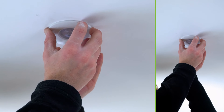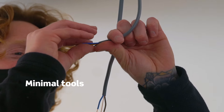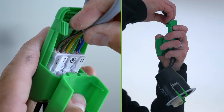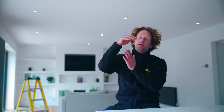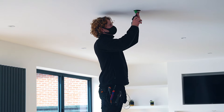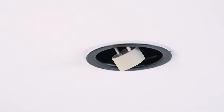The reason this light fitting is so quick and easy to install is because of the minimal tools you need — there's no up and down your steps back to your tool bag. With a fixed terminal block it can be quite awkward to feed it up into the hole, whereas with the fireguards you can just feed the cable up, push that termination box in, and then fit the light nice and easy.